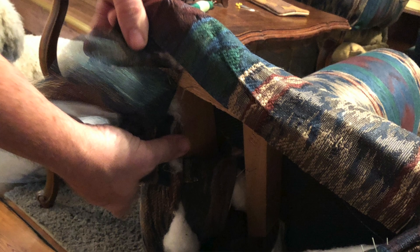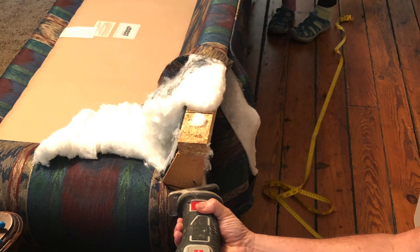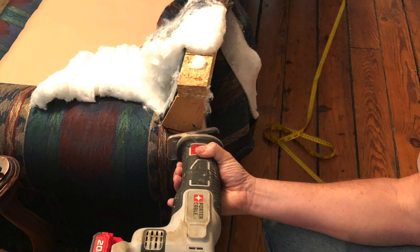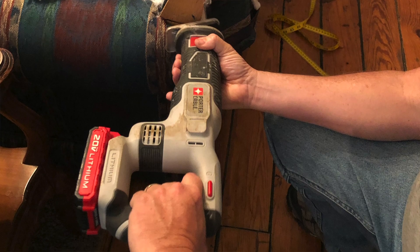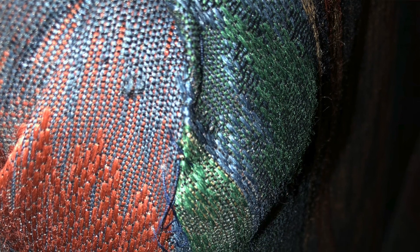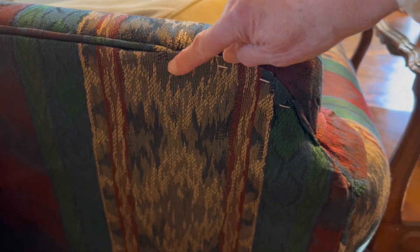So let me show you how we did this. We opened up the corner of the couch, carefully picked the staples out, and opened the fabric. We saw that we could cut the wood of the corner, so Mark got out the sawzall and started cutting. I said, what's going to happen if it doesn't fit? He said, then I guess we just throw it all back together. He cut the corner off, and then I came in with some extra batting to fill in the shape we wanted, then pulled the fabric together and folded it under itself so it fits snugly on the corner, and stitched it together. This is where the back board of the couch was.